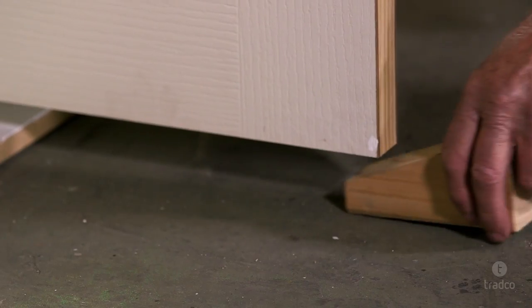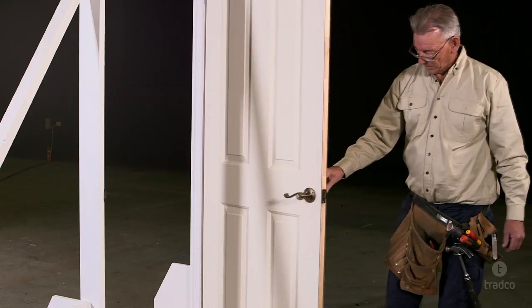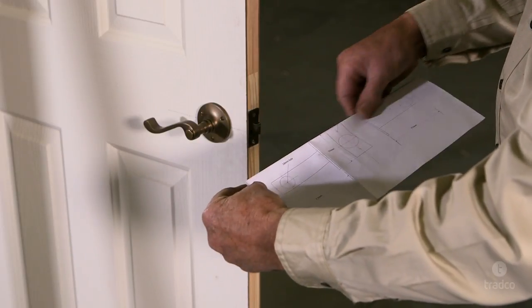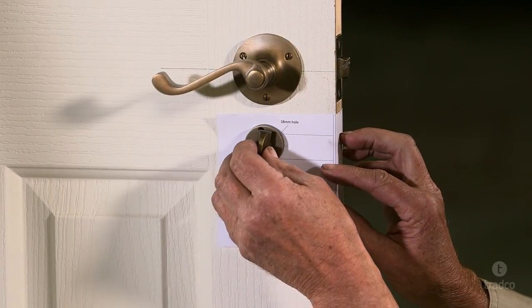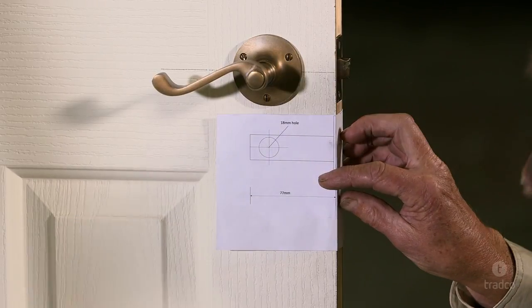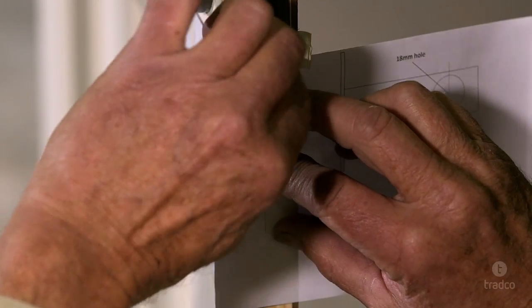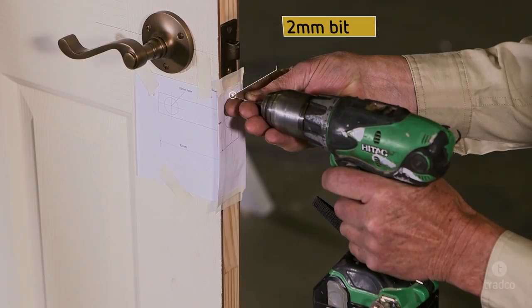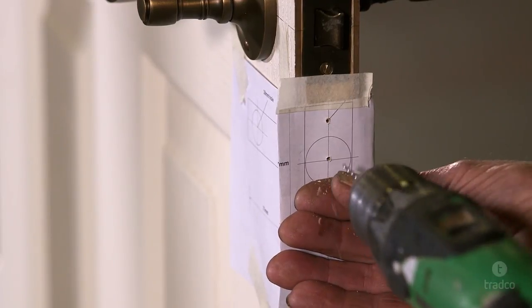To begin, place your wedge under the edge of the door to keep it steady while working. For the purpose of this video, we will be showing the privacy bolt installed beneath an existing tube latch and lever. To determine the appropriate location of your privacy bolt, fold the template on the door edge, making sure that the top of the template is not overlapping the tube latch faceplate. Place your privacy turn over the spindle hole on the template to ensure that you are comfortable with the location, and affix with tape. Then fold the template around the door edge, aligning the vertical centre with the centre of the door edge, and affix with tape. With a 2mm drill bit, mark all of the drill marks and elements of the template, making sure to push the drill bit right through the face of the door to the other side.